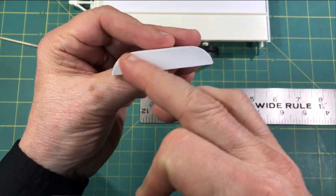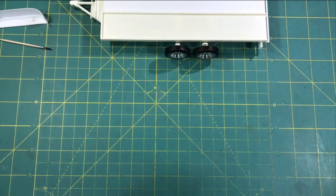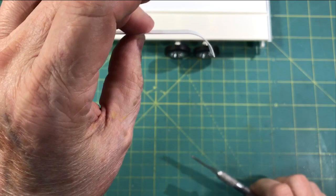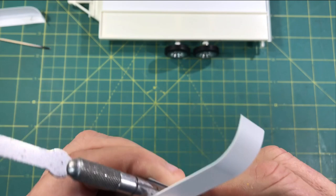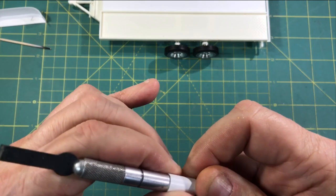To get our bend, we're going to need a piece of just plain sheet plastic to transfer that over to — and this is twenty thousandths, by the way. All I did to get our shape was I took my hobby knife handle first and simply roll this around until it touches the other side. And I'm going to do that on both sides. Now it's going to spring back some, but I'm going to show you how I will fix that too. Center it up and roll that right around until it touches again. You see we've got pretty much a good shape, but you see how this one has sprung back a little more?